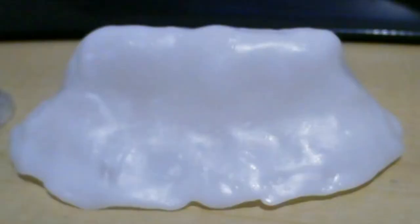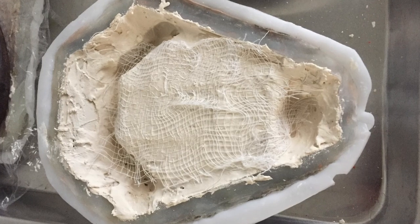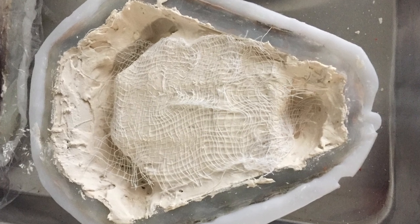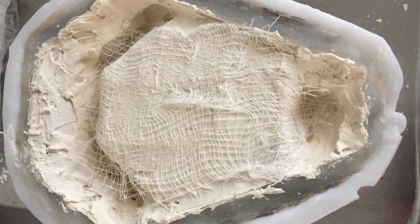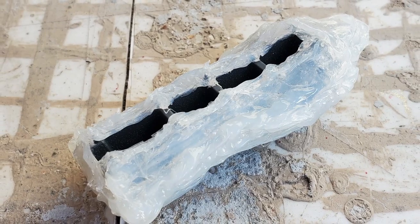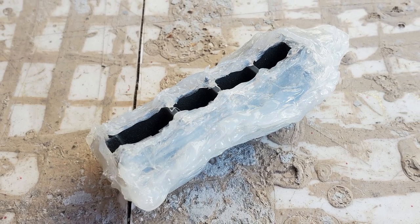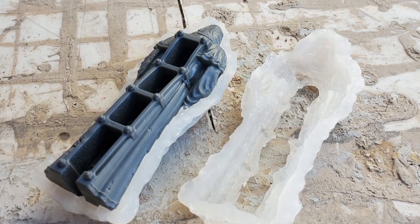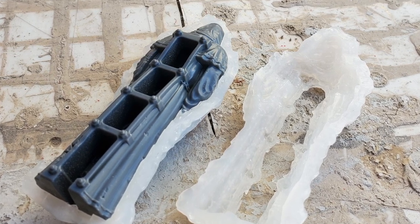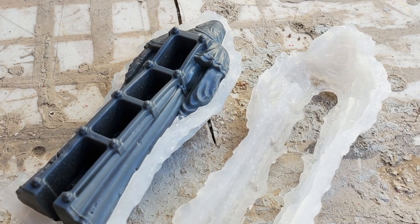In the case of this barricade, I used a silicone with an aggregate in it, and then shaped a shell around the silicone using thermoplastic. On the particularly large casts, you're gonna want to put some sort of support into the casting material as well — I would suggest stuff like cellulose fiber, medical gauze, or wire. And in case you're wondering, this particular technique isn't limited to just one-sided molds. You can make two-sided molds: the trick is to only partially cover the object you're trying to cast, then split it in half and finish the remaining side. Note that wherever you're planning on cutting the mold should be where the silicone is applied thickest.